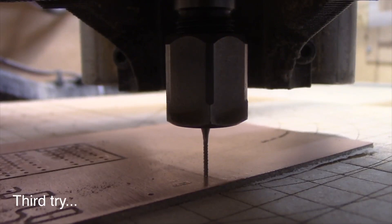I made some changes to the program: I adjusted some of the lines that were cutting a little close together, set it to go half a millimeter each cut on the z-axis, sped up the z-axis a little more, and sped up the other axes slightly. Let's see what happens.